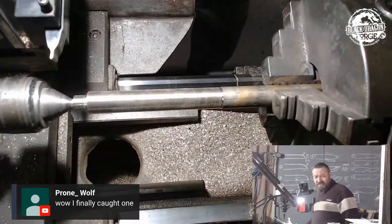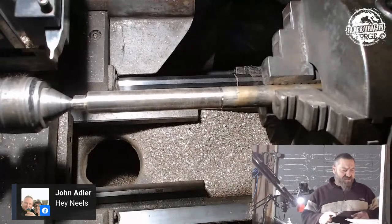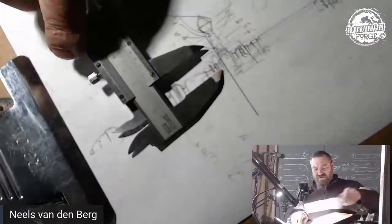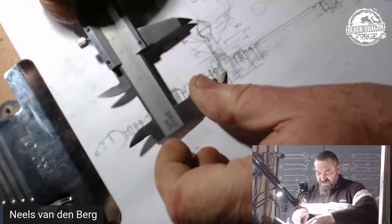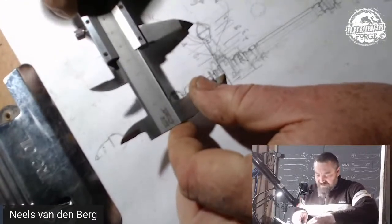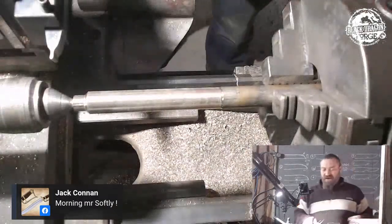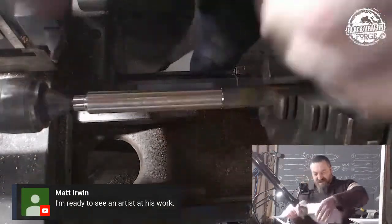All right. So before further ado, I'm just going to measure from the center of the Quillon, also known as a cross guard, from the center mark out. Let's see the amount of material. I'm going to go a couple of mil over. I require about 40 mil, so 80 mil in total working area in this little baby. So let's just mark up 80.